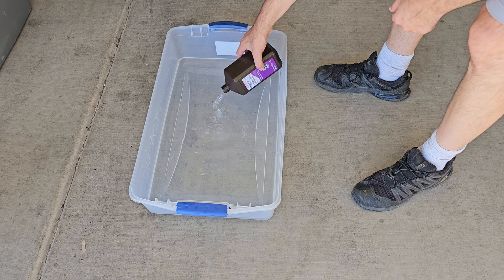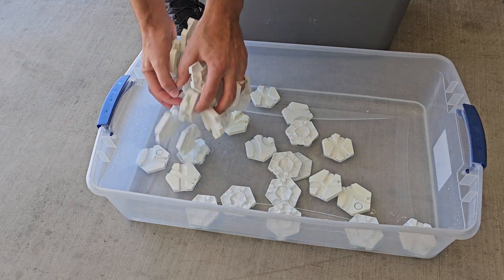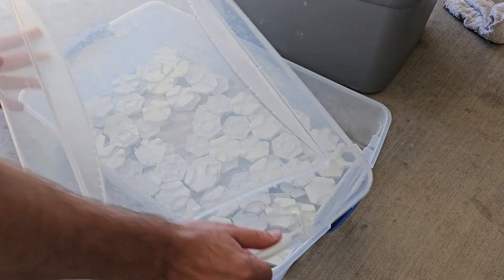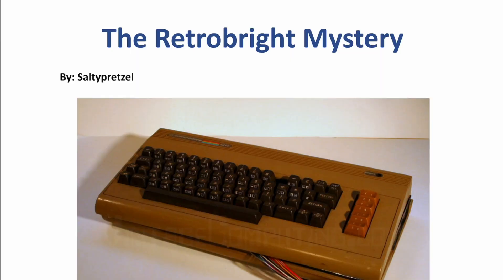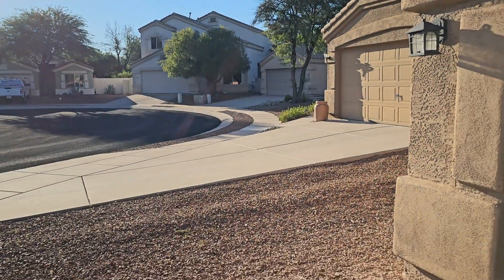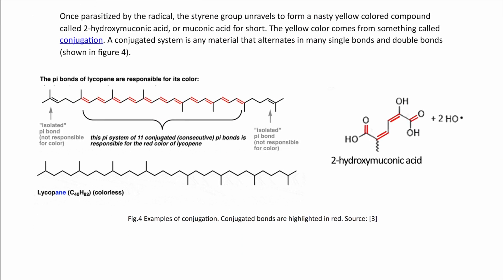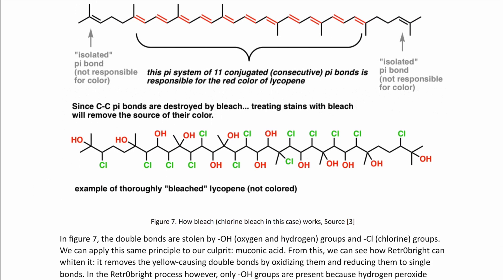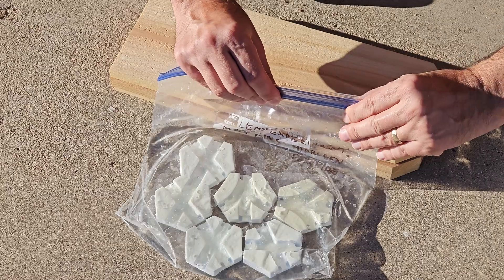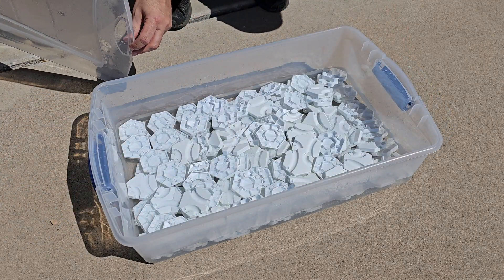Next I tried the sun method. This involves placing the plastic in a clear container or Ziploc bag with full-strength 3% hydrogen peroxide solution, then placing it in sunlight. This is counterintuitive because the sun yellowed the tile in the first place. But there's an article online that explains the chemistry: the sun's UV light provides the energy both for the original oxidation that yellows ABS plastics, and for hydroxide groups from hydrogen peroxide to re-whiten the plastic. I found the sun method works very well — even on a cloudy day, tiles turned white within three hours, and on a fully sunny day I saw amazing results in just one hour.